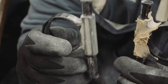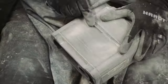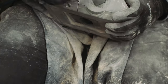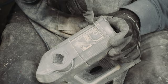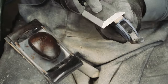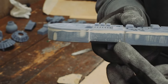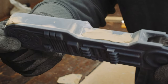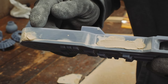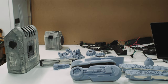Here you can see a quick before and after example of a filled part. In order to preserve as much fine detail as possible through the sanding, filling, and priming process, I was sure to go back through the nooks and crannies with a small file to remove any wood filler that shouldn't be there. I used the same method on all the pieces glued together — using wood filler to fill the gaps and then sanding everything flush. Here you can see some extra wood filler added to fill a few more problem areas, and with a little bit of elbow grease, all the parts are nice and filled.